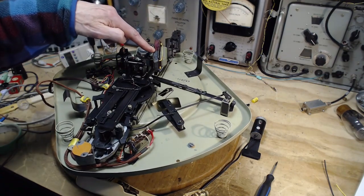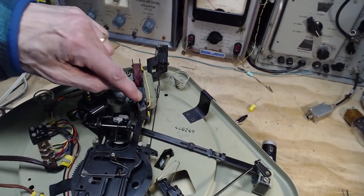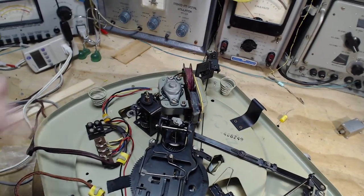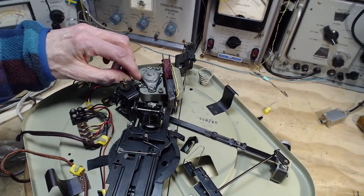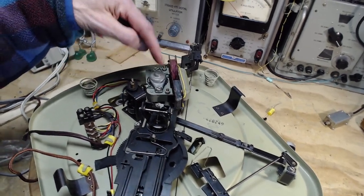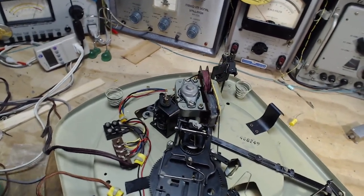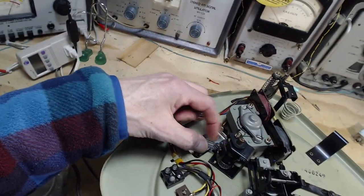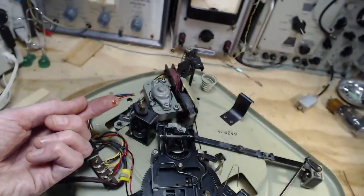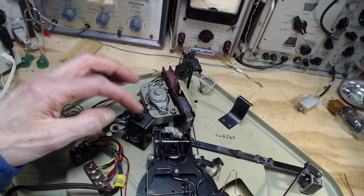That's interesting. Here's the motor. You can see the windings on the motor. They're right exposed here. You actually see a little bit of copper in there. So now the motor has a bearing here that's probably worth lubricating. I mean, just looking at everything else, and this is all dry in here. So interesting enough, there's oil there. I have fresh oil right here.